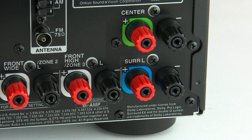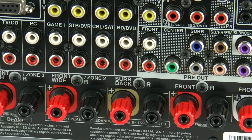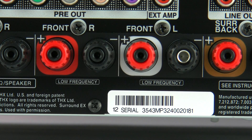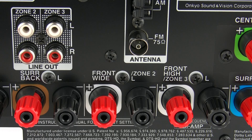Lastly are the speaker configurations. Depending on what configuration you're using will determine how you wire this up to your speakers. One thing that has changed and been added to is the bi-amping mode, which is a little different on the 818. What's been included now is a digital crossover — a vast improvement over crossovers within speakers or any other analogue crossovers. This gives you separate high-frequency and low-frequency outputs directly from the back of the AVR, so when outputting in bi-amp mode the end result is much, much more accurate. I hope you've enjoyed this first look at the TX-NR818 — see you soon, take care, bye-bye.